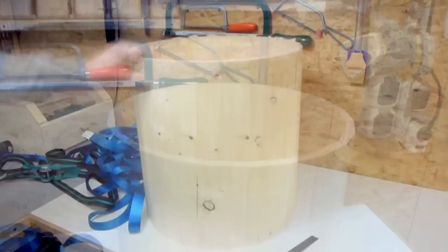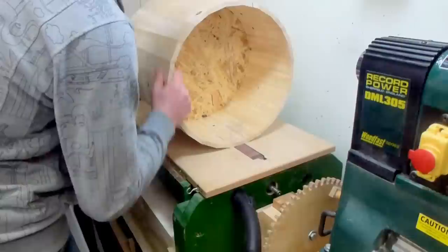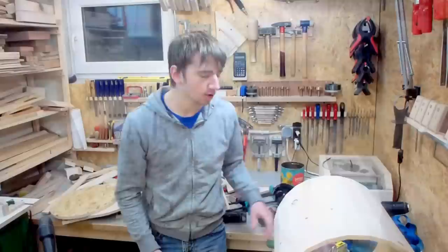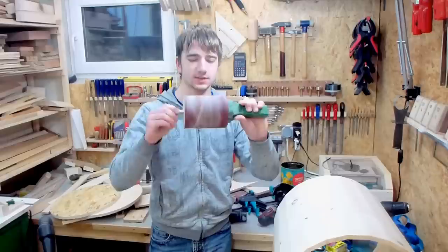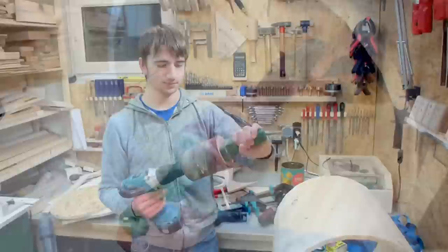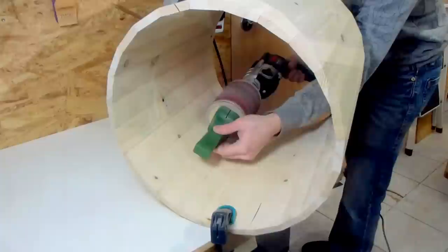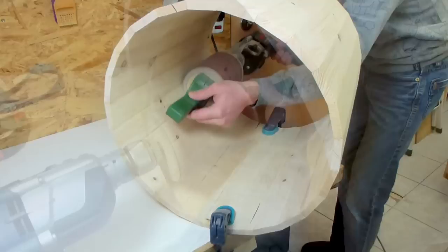Thanks to the strips of tape there is no glue squeeze out on the outside. As a collection bucket this needs to be airtight, so before going on I had to fill some small knot holes and other gaps with epoxy. Once that was dry I sanded the outside with the drum sander and by hand — well, with a handheld sander. Sanding the inside smooth is easier than you might think because I have a portable drum sander with a shaft, bearing, and drum that attaches to a drill. It was actually the first time I really used this tool and it is a lot of fun and really effective, though it draws a lot of current so I quickly had to switch to a bigger drill.